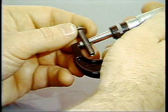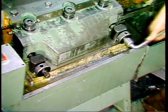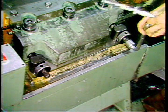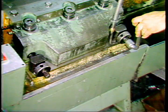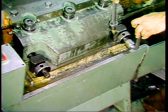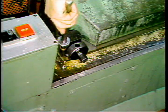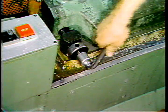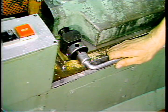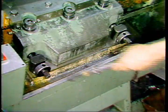The major diameter will be below tolerance on this blank. Loosen the lock screws, then turn the die squeeze adjusting nuts clockwise to increase die squeeze. Turn both adjusting nuts an equal amount. Be sure that you tighten the lock screws. Thread roll and measure another blank, and further adjust die squeeze as needed.